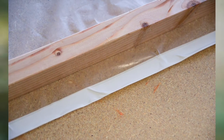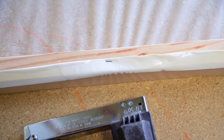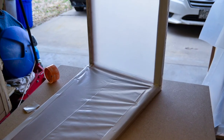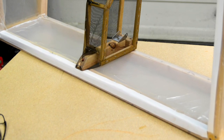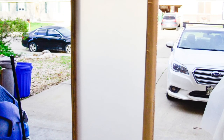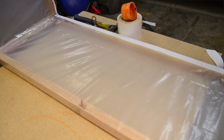I started by reinforcing the top and bottom edges of the plastic sheeting with the tape. I stapled the bottom edge to the bottom of the frame, then stretched the plastic over the top rail, attaching the remaining tape-reinforced edge over the first edge making a tight loop. I then wrapped that seam where the two ends attached to the frame with another piece of seaming tape, so the tape is taking the stress of the tension rather than the staples. I did each of the four walls separately and then used the Gorilla tape to seal the corners where the walls meet.